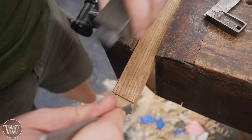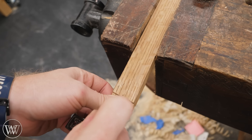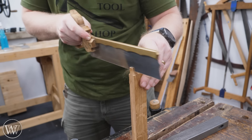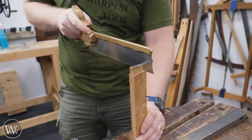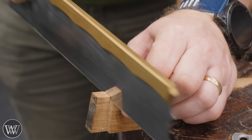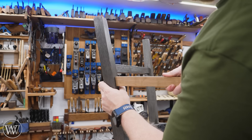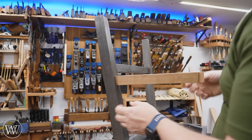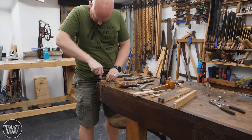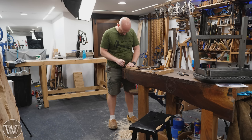For the tenons, they actually need to come off at an angle. I'm going to put the original on here and mark where they're at, then use this end of the square to make them come off the shoulder square. With that simple mark we can cut down the other cheeks and then the other shoulders, because it's going to have four of them running all the way around it. One thing I didn't shoot: I cut these into a square tenon and forgot to turn on the camera when I grabbed a file to round over the corners until it wiggles in there nice and tight. I don't need anything terribly perfect, but since there's going to be no hardware — just glue — we want it relatively tight. I just want to make sure the first one fit before continuing on.